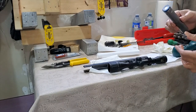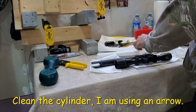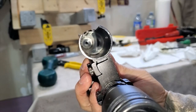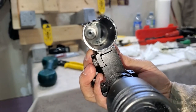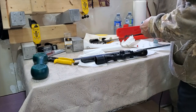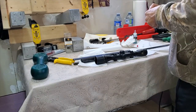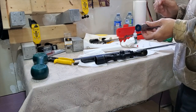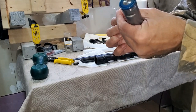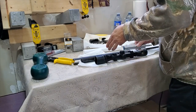Inside the cylinder it's pretty clean, but I still see a few things in there so I'm gonna take those out. Don't use any abrasive stuff in here — I'm gonna use just a drop of oil, just to wet the seal. This is just to measure how much force I really need. To push it inside, I made a tool from plastic cut out of a water bottle — it's very thin and this will help slide the seal inside.